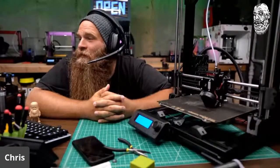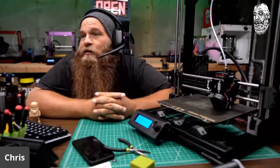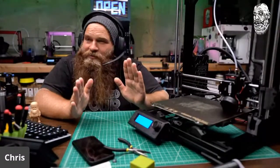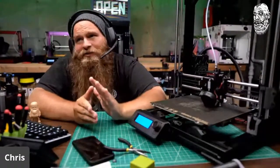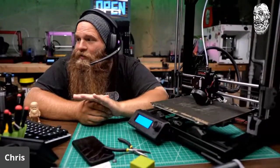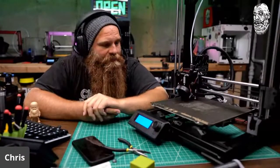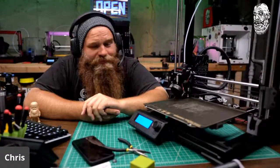Yeah, sensorless homing on Core XY is a lot harder because you need two motors to sense stalls. Not the easiest thing. Two motors at the same time, mind you. Not just one. Marlin did add better stuff for core kinematic sensorless homing.